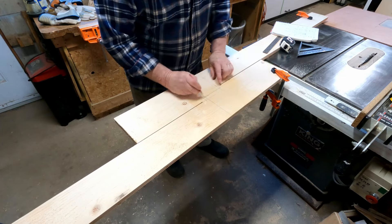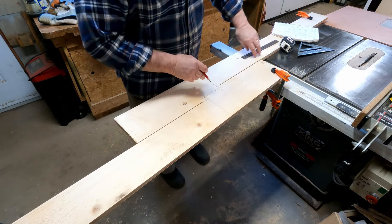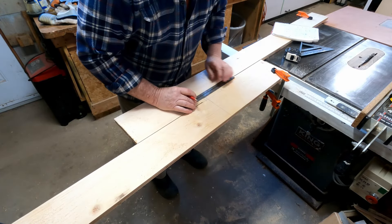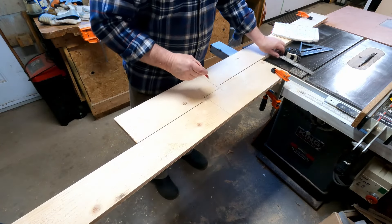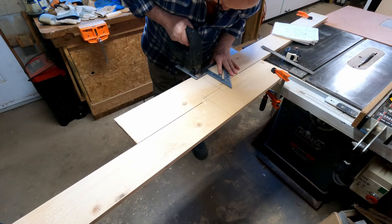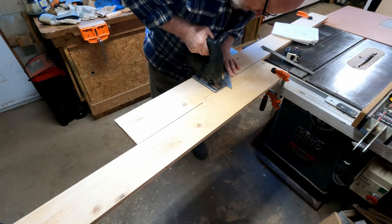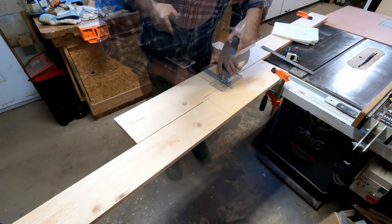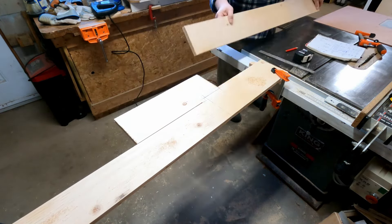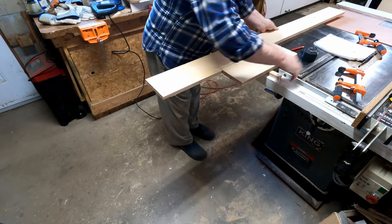What I have to do is from this point to this point I have to halve the material — it's almost hard to explain. I measured in here five and a half inches and in here five and a half inches, and then drew my line. So now I'd like to cut along this line, along this line, and along this line. When you're trying to save wood you end up making some complex cuts — they're not really complicated, they're just straight cuts, they're just complex.